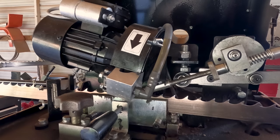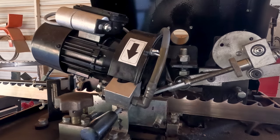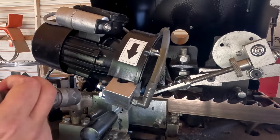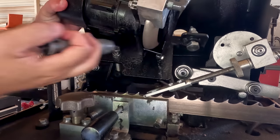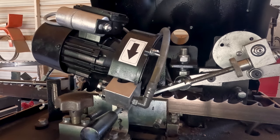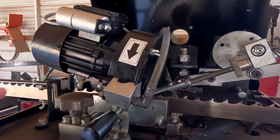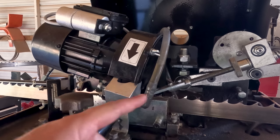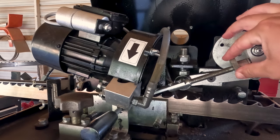Now this sharpener is easy to operate. Once you put your blade in it, you run it around a few times and you stop it with the stone in the gullet. And I always grab a flashlight and look in there to make sure the grinding wheel, which is this part right here, is falling right there in the gullet so you can get a proper grind. Usually it doesn't take but a few seconds to set this up. And if you don't mess with it, you usually just leave it alone. I've not messed with these settings in a long time, but I use the same blades every time. If you use a lot of different profiles, you have to change this wheel out, and you will have to change the power feed just a little bit, not a whole lot. It's easy to adjust. You just move this screw right here in and out, super simple.